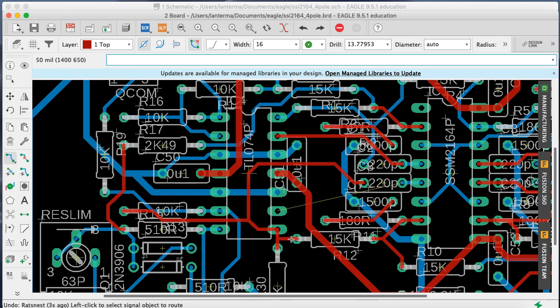Actually, since this is an output, let me do this to make that clear. Again, it's a signal flow question. I know that that pin's an output, so that makes the signal flow clear that there's an output going to multiple destinations. Now, obviously, I don't have the pinout of the SSM memorized, so I'm not being super consistent with that convention.